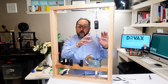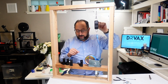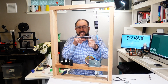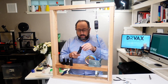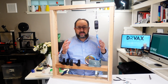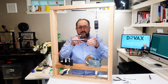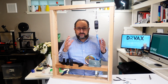The concept here is really very simple. I wanted a mechanism where I could put a measurable force on these shelf brackets. When you think about a shelf bracket, the weight isn't really pushing down on the end — it's pushing down uniformly across the bracket. Ideally, I'd have cables attached pulling down in the middle, but that was a little too complex for this exercise. The purpose is not to measure the absolute strength of these brackets — for that I'd need many prints, solid fills, and many tests. What I want to see is the relative strength of these different materials.